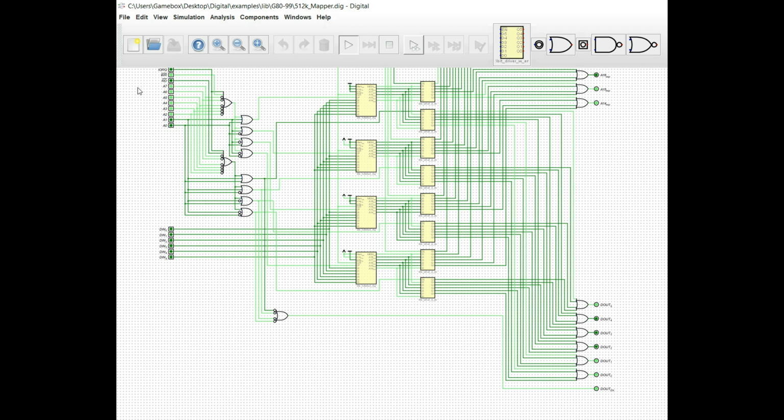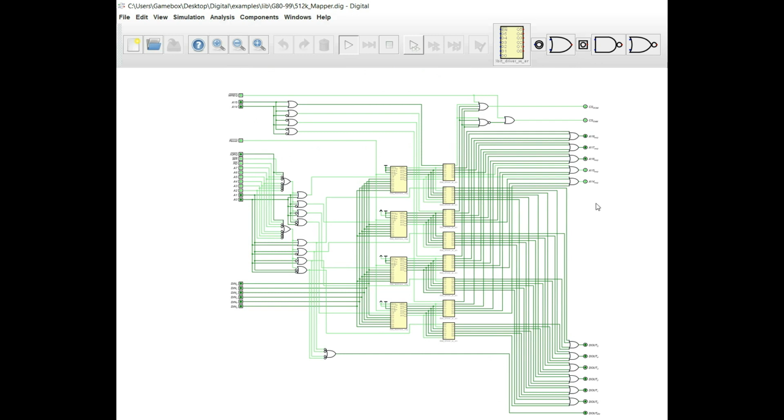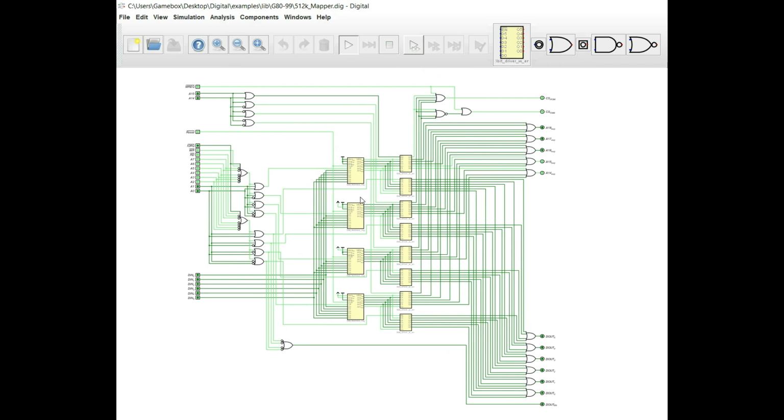If we write the read signal low, we now get that data on the output port, and what we get is 2, 3. So that's a top bit right there, bit 5. And bit 0 is down here. And then we have our D out signal here. And the D out enable, again, that's used externally to help gate this tri-stated on the outside of the diagram. So if we raise the read select, all those go back to 0, and we still have that data up here, as you can see. So that's the essential operation of it.